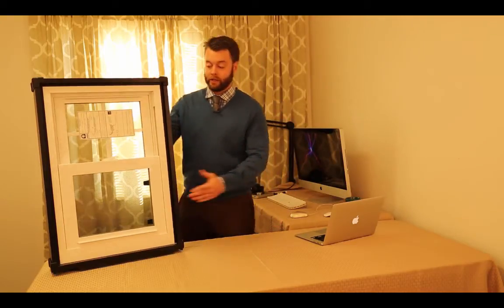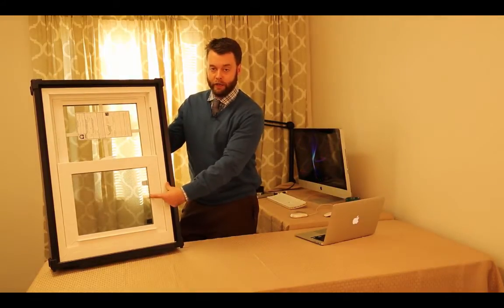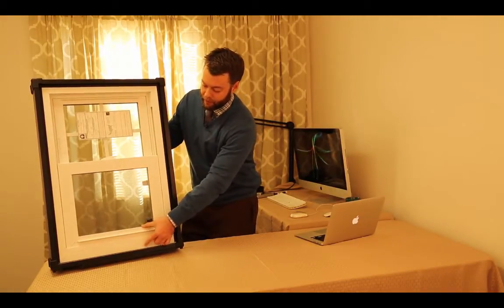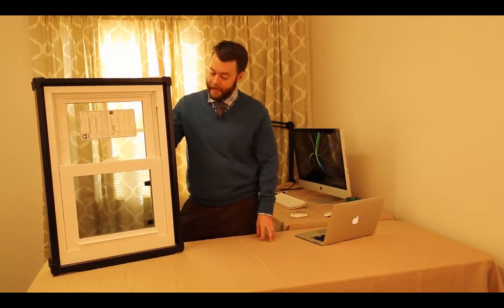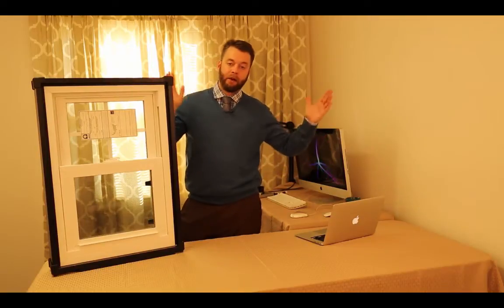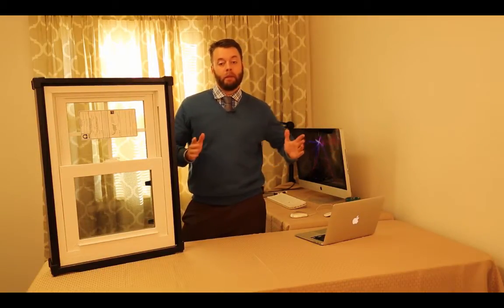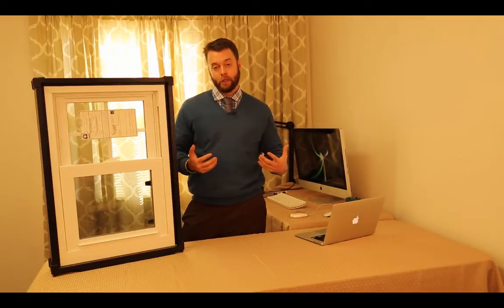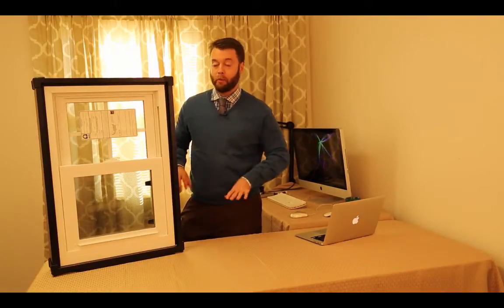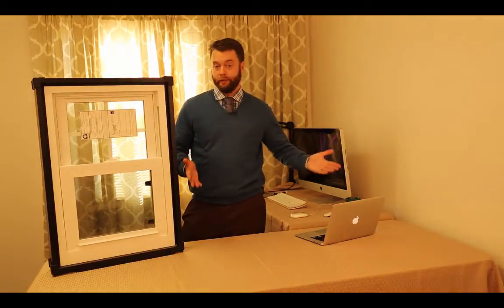Taking a look at this window, we're going to start on the inside. What you'll notice right off the bat is you've got a relatively thick frame and sash here, and you get the same thing on the bottom. This is the same thing you'll get with the Simonton 5500 window that we've reviewed previously, and it's not an ideal feature. If you've got a smaller house with smaller windows, it could make a very dramatic difference in the amount of light you get. There are other models in a similar price point that will give you more glass area.